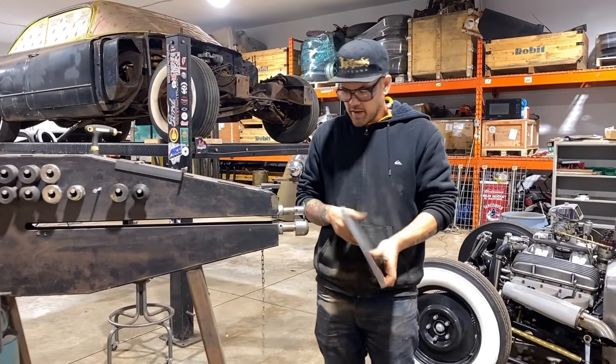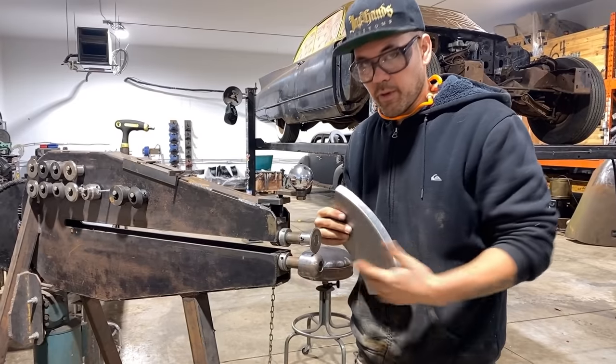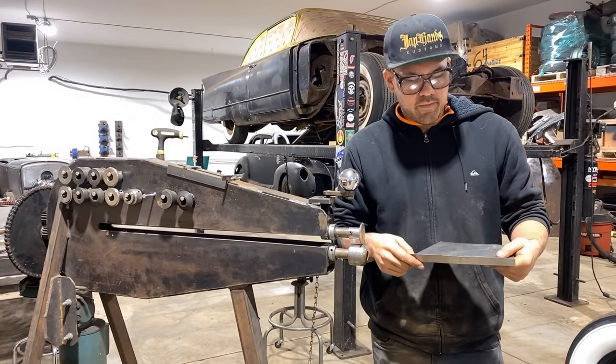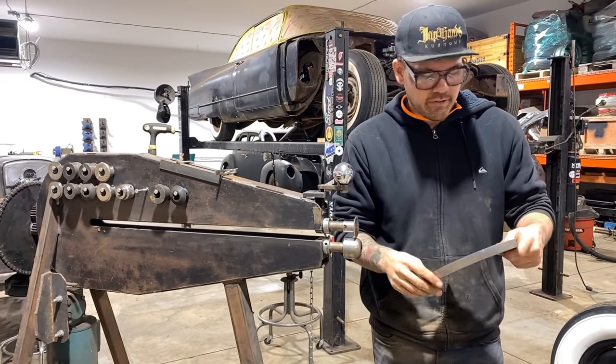We went through a few more times and we're almost at 90 degrees, but there's a bit of a limitation on my die — it has a bevel on both sides so I can't quite tip it all the way. I'm going to finish this off with a hammer and dolly to get the tip all the way to 90. Right now it's probably at 80 degrees. You can see we went overboard with the shrinker — pre-shrunk the flange and now we're back to needing more shrinking. There is quite a bit of shrinking that happens in a flange on an outside radius like that. I'm actually tweaking it with the shrinker to tip that edge even further in, and it's working.